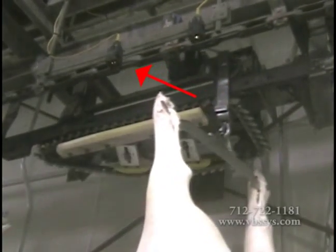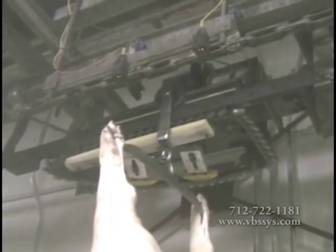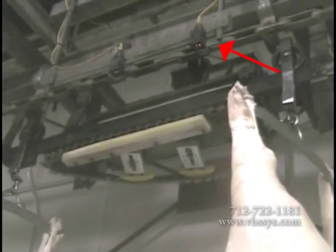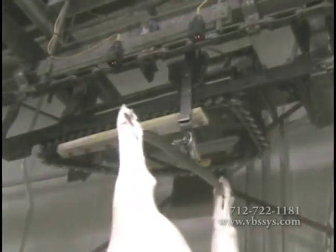At this point, a signal is sent to the weight indicator telling it to start the weigh cycle. A stop photo eye is mounted across from the end of the live rail. As the trolley passes, a signal is sent to the weight indicator telling it to end the weigh cycle. The weight indicator displays an average weight and transfers weight data for further processing.